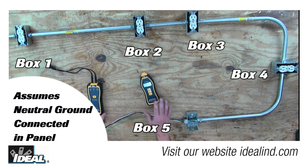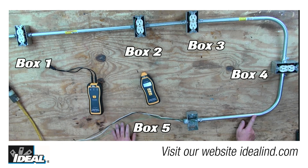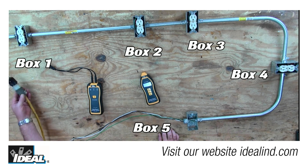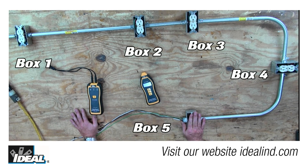I don't have an example of what that might look like in the field, but here's a made-up example on my benchtop. I've created a short between the hot and ground conductors here in the metal conduit. I've also terminated the conductors to a plug and, using the extension cord, plugged these outlets into a known circuit with its breaker tripped.